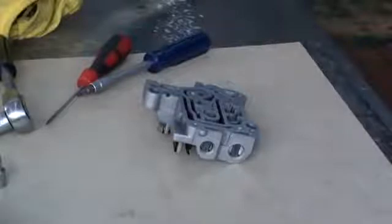Before you start to do any of this, you need to be prepared for lots and lots of little bits that come out. You really need to be careful with ordering all the pieces, making sure everything gets bagged and that everything goes back in the same order it came out in. My advice is to have your camera handy, take lots of photographs of every single piece that comes out, where it came from, its orientation, and the order it came out. There are lots of bits that are slightly different but look kind of exactly the same, and it will be very easy to get mixed up, leaving your transmission not working correctly afterwards.